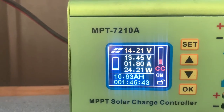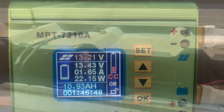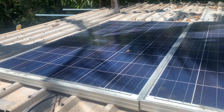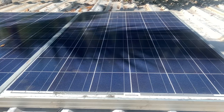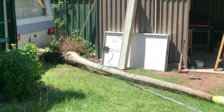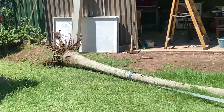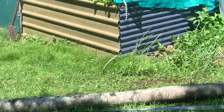In the middle of the day with the sun out, we're only getting one and a half amps — why? Let's have a look at the solar panels. They're shaded by a palm tree. After moving them — that's it! Don't worry about the tree, it had to come down anyway and we have hundreds more. Instant results.